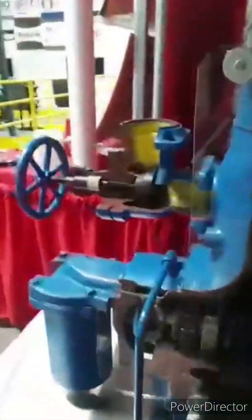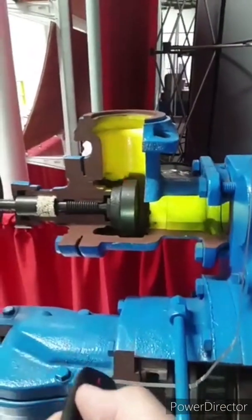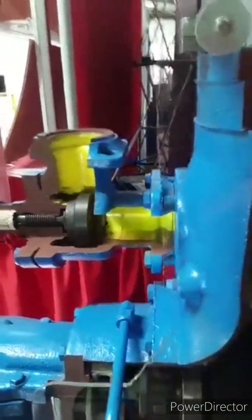Let's start over here with our suction valve coming in. All of our ammonia gases are going to be coming in, going through the suction valve and through the suction intake in this direction. As we come inside the machine, the suction port right here — the suction gas is going to come into that yellow manifold. The gas is trying to get over to this piston, and you can see it going up and down right now. If we're in a loaded position, it should compress. If we're unloaded, it's just going to push it right back into the suction manifold in this yellow cavity.